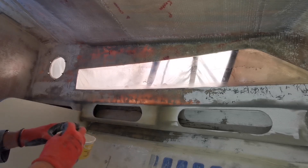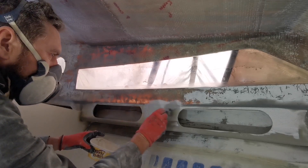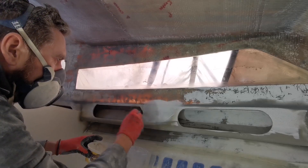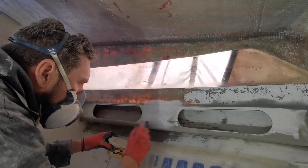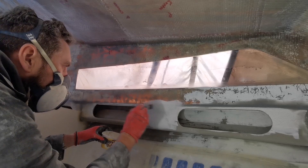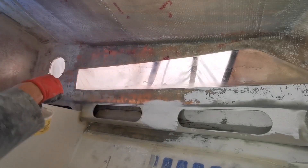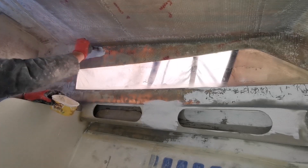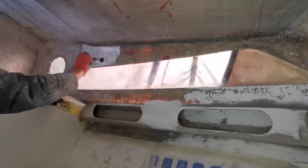Right, so we've got a little bit of gel coat mixed up there — not a lot. I'll just put a little bit on here just to see what she looks like. There's a few little pinholes and stuff there — push that into them. Next time I come down that'll be like a filler, filled the little voids. So rather than having to mix up some bonding paste, the gel coat will do the same job really — just fill the voids, all the little holes. I'm probably not going to have enough to do all of this with a heavy coat.